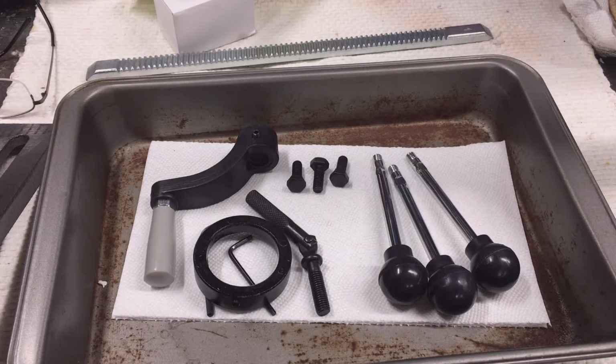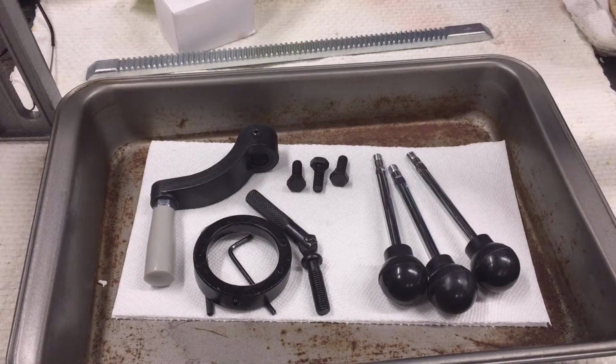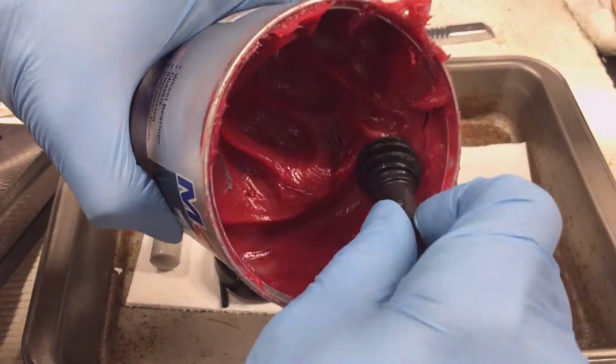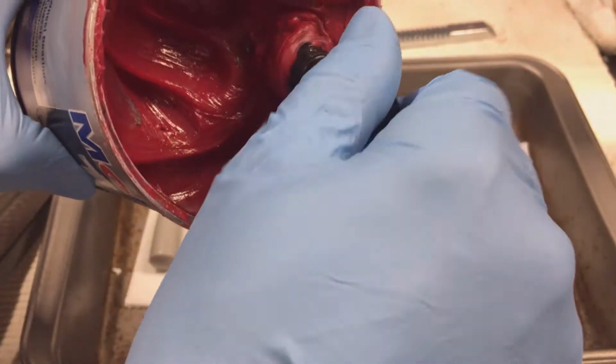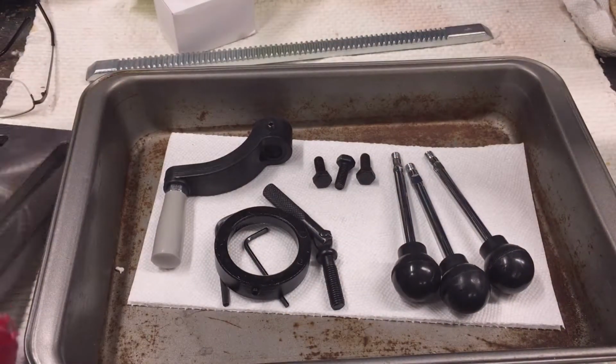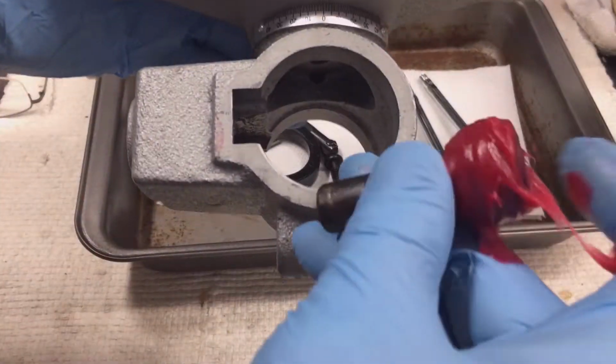Feed the gear rack through the slot in the table assembly so that the teeth are facing out and the longer smooth face is up. The worm gear should engage the gear rack. Using both hands, slide the entire table assembly and gear rack onto the column until the bottom of the gear rack is positioned in the base, against the column.